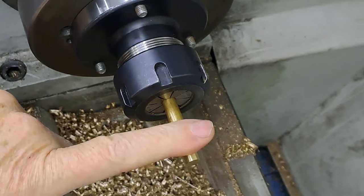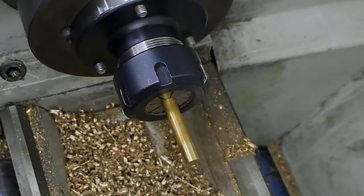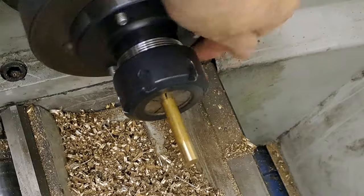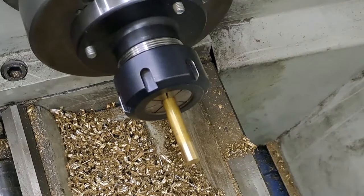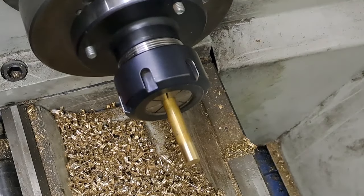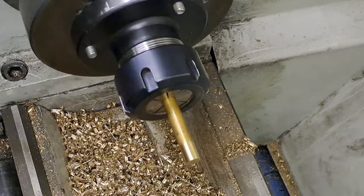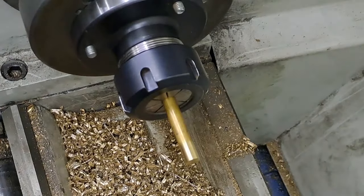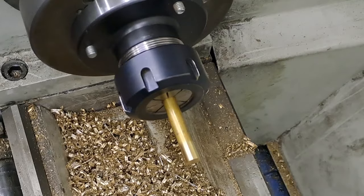So I'll show you the first one, then I'll go off camera and make the other 9, and I'll bring you back. Lathe is set on 1200 rpm. Seems to be a favorite of mine, I know, but never mind. So we'll get the lathe going, just polish that up a little bit, and get a little bit of emery paper, very smooth old bit, and then a bit of Scotch-Brite just to make it bright and shiny. Here goes.